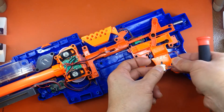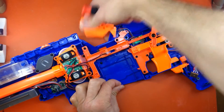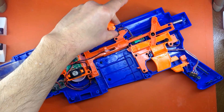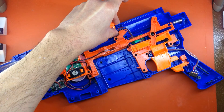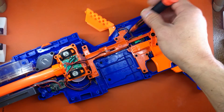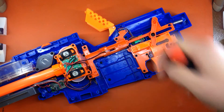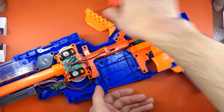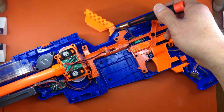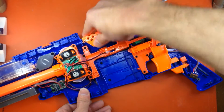This wiring is going to be replaced with some heavier gauge silicone. We'll also be removing the jam door and the jam door latch, which has to be in the closed position to complete the circuit. We're going to drop that out because it's not really necessary. We could leave the switch in and rewire it with a voltmeter — that's always an option. This little switch here doesn't really interfere with smooth operation, so it's a good candidate for a voltmeter activator: when it opens, wire it to give a voltmeter reading, and when you close it, it turns the voltmeter off.